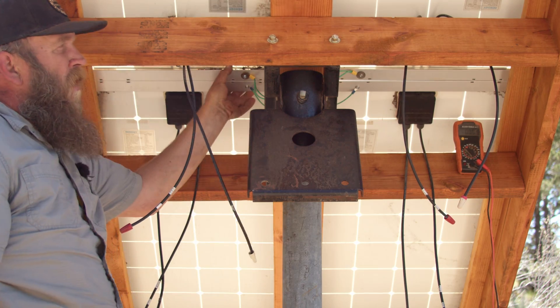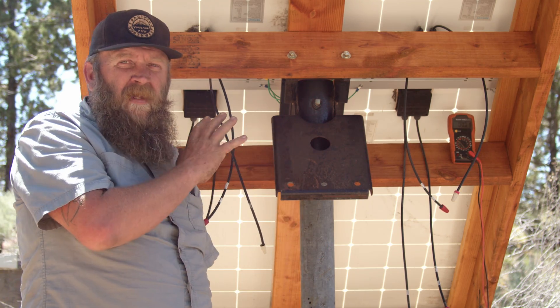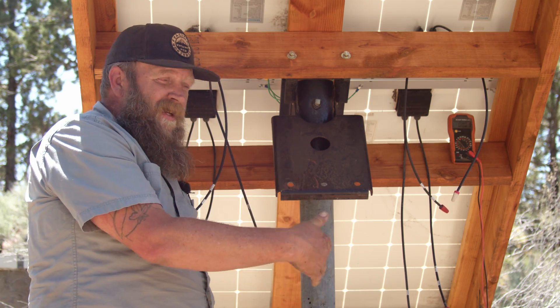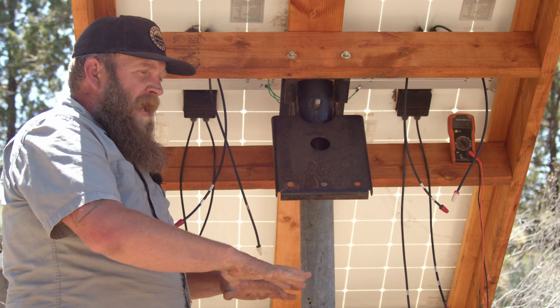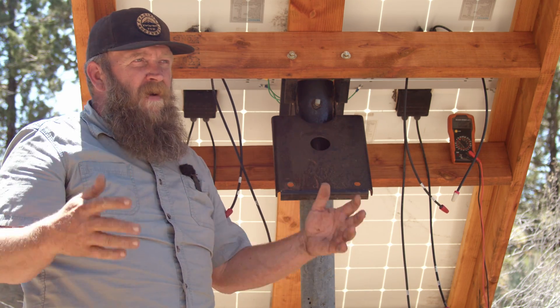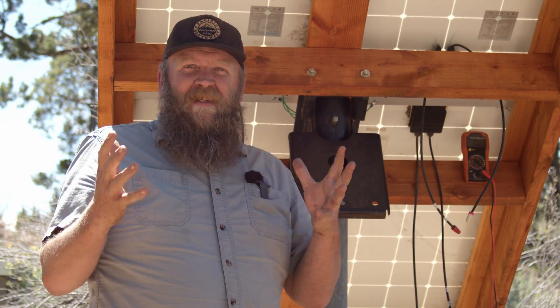All four panels are now bonded. I'm not making any other connections other than the ground connection. I'm going to run one long ground wire into a box that'll be mounted here, and run wires from the charge controller — which will be in that box over there — with no power run to it yet. When everything comes together, I make two connections with MC4 connectors and I will never have come in contact with any of the high voltage that everybody seems to be so scared of. That's why you do all the safety stuff first. Since I've said so many words about bonding, let's do grounding in the next video.